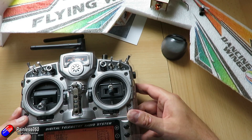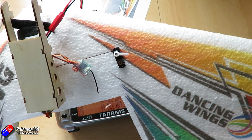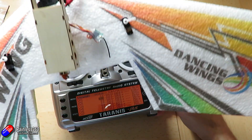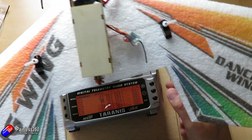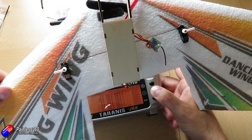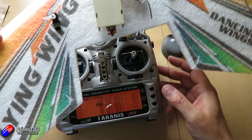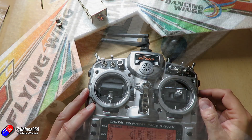The last thing to do is get these servos to exactly 90 degrees, because at the moment they're not quite there. I'll go into the sub trim menu, go to channel 2 and adjust the sub trim until that servo reaches 90 degrees — that's pretty close. Then go down and do the left-hand one, adjusting the sub trim the same way until it's pretty much in line. That's pretty close. Now the controls should be okay.